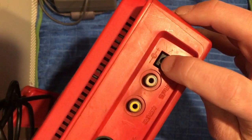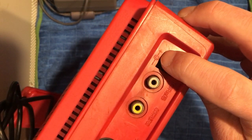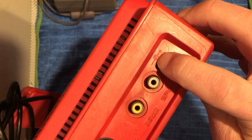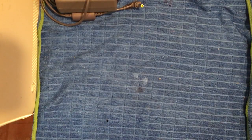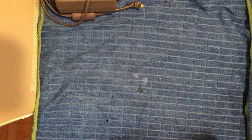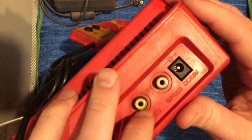If we flip this over so that you can read it, we need DC 7.5 volts in. Furthermore, if you look at the little diagram at the top, that's telling us it's center-tip positive, and that's important to look at — if you get the wrong polarity on your adapter you could definitely wind up damaging the system, which I don't want to do. I just picked this up, so we need to find a solution.